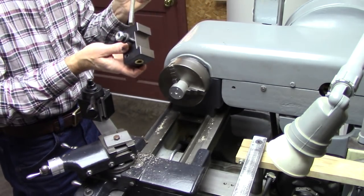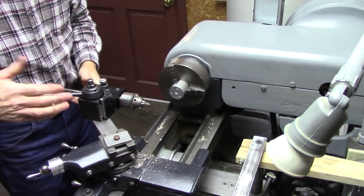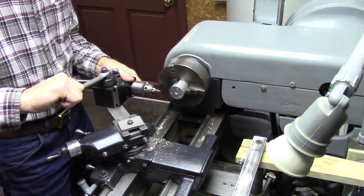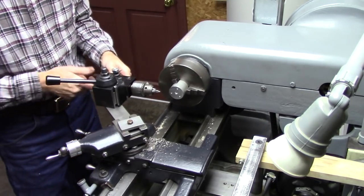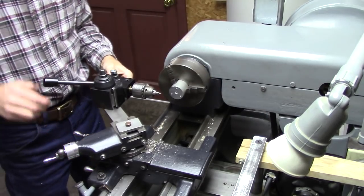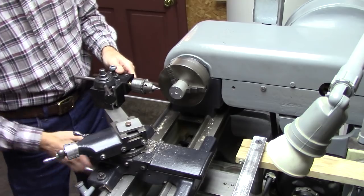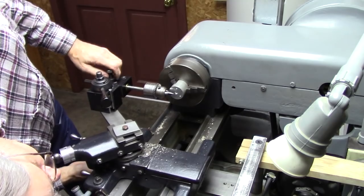Now you've got to reverse this. It looks like I'm a little bit out of alignment here, just eyeballing it for now. It's not real solid, but it's solid enough to drill some holes on the outside perimeter of that. Because of this height difference you've got to adjust it up higher. And if you want to get critical, you can run it into center and get your center height exactly right — I'm a little high there.